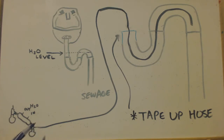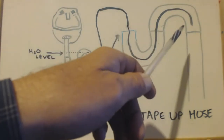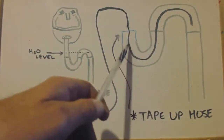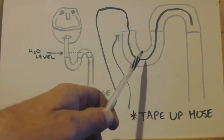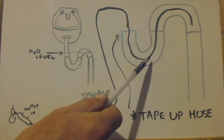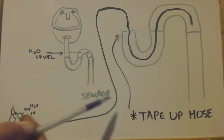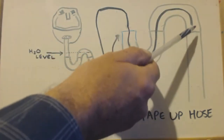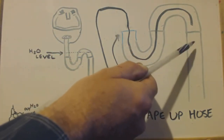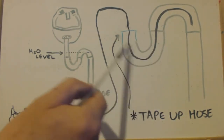Before you connect it up here, blow through it to get the water out. I'd try to blow through it to get the water out of there, and push it down in there. Now when your fumes come out, they'll travel through the hose, and they'll go down into this area here. And they can't come back into the room because you have this U-trap.